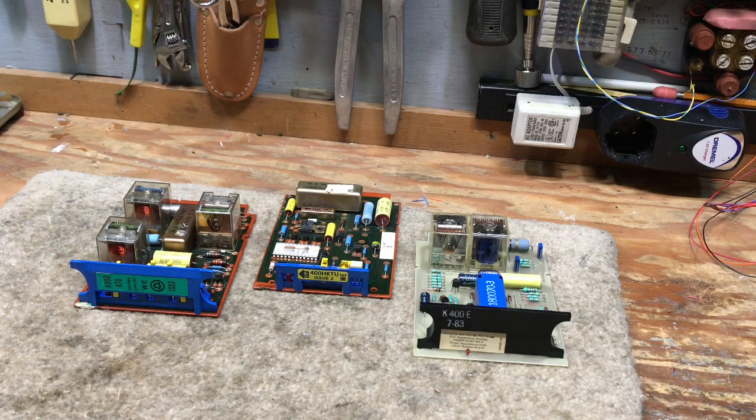Otherwise, you could use any KTU. So if you're using a conventional standard telephone line from a conventional telephone company, pretty much any KTU should ring up without any trouble, as long as the KTU is, of course, functioning. When you get into intermixing phone lines and voice over IP type services, you can run into trouble. If you disconnect the phone line and connect an ATA to that port, where that phone line used to be, then you've now got a circuit card potentially that's looking for grounded ringing, and it will not ring up. It'll work fine for placing a call on hold, but you will not be able to detect an incoming call.